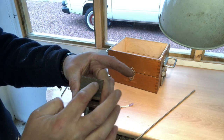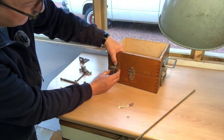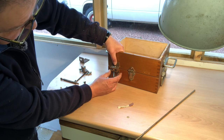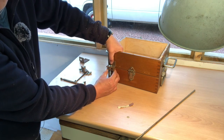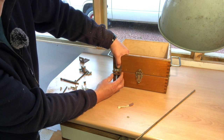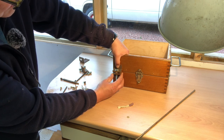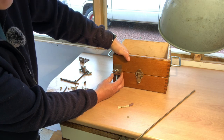For the alignment dowels, I've got these nice heavy angle irons, a long bolt with a short nut, and a matching item which has a reasonable fit - I think I've got about half a millimetre clearance maximum, which is more than accurate enough for me. I'm going to pop two holes in each of these brackets and screw them with some good screws to the side of the box - both on this side. That way I'm giving myself a bit of foolproofing, meaning I can't put it on back to front, which is a potential casting issue.